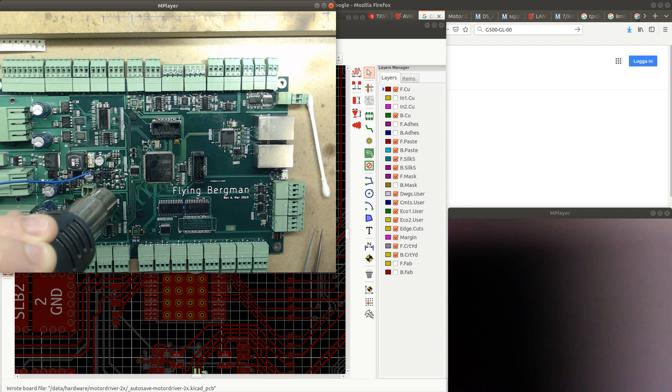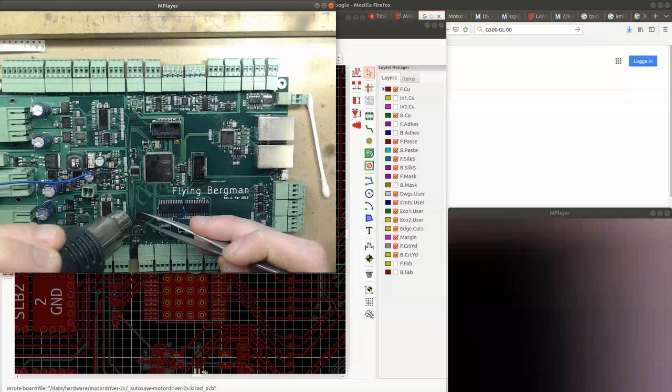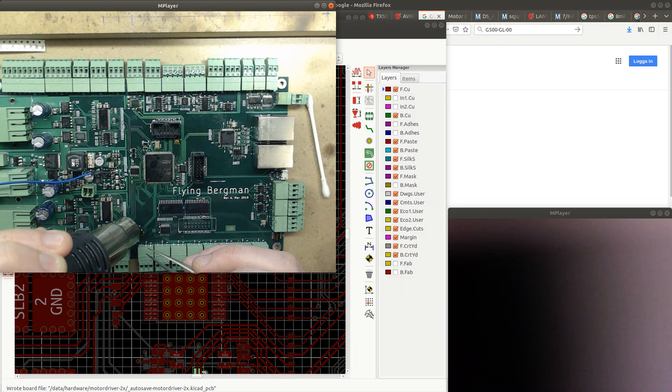Soldering on this chip, making sure that it's properly soldered. And I'm also going to solder on these chips which I removed. They are fine now. So if I had to do this search again, I would look at the chips first and desolder the chips that could have a solder bridge underneath, and then look at the most obvious sign of shorts on other components.